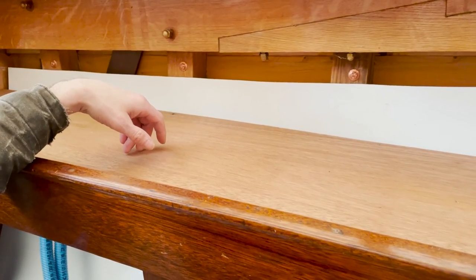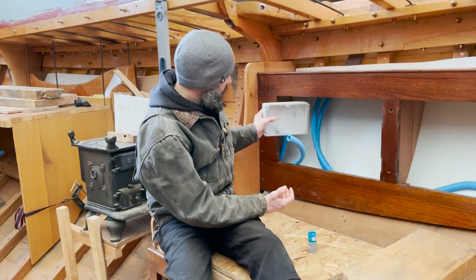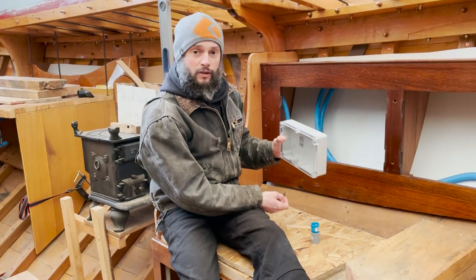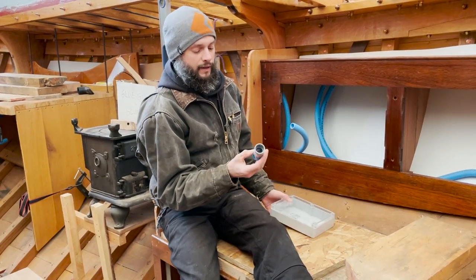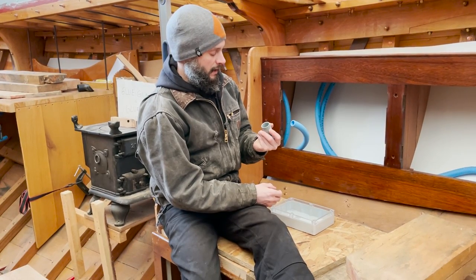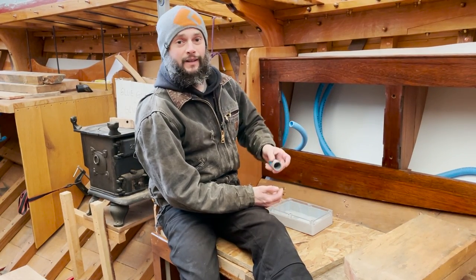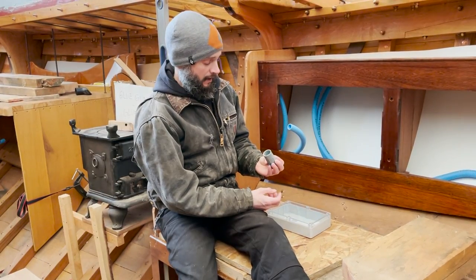So now that this is figured out, I can confidently and comfortably place the junction box in there against this bulkhead and make sure that we have enough clearance. And I got all set to do that and drill the holes to put in the fittings and realize that these fittings are a very oddball size. So in imperial measurements, they are 1 9/16. And I don't know about you, but I don't stock a 1 9/16 bit in my kit as everyday use. It's a pretty funky size.